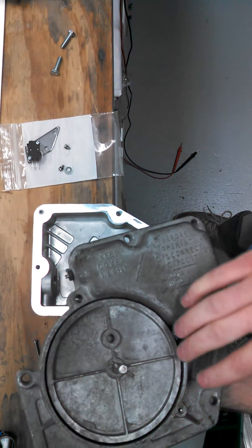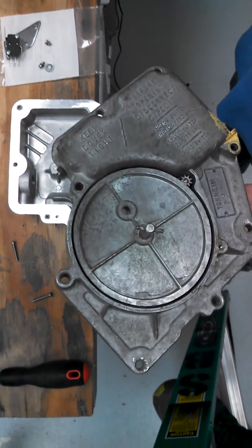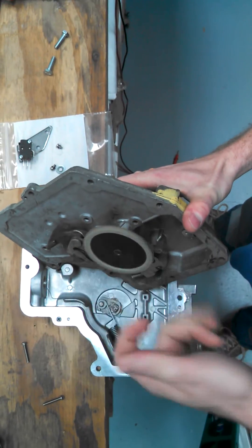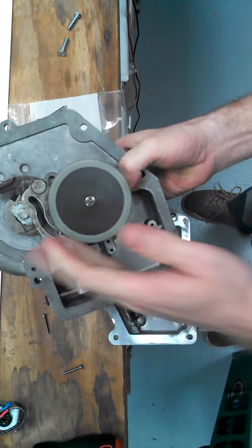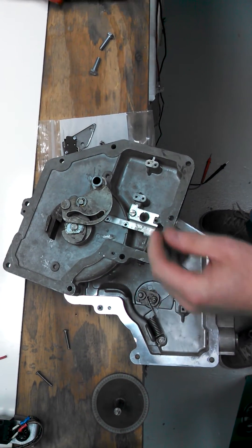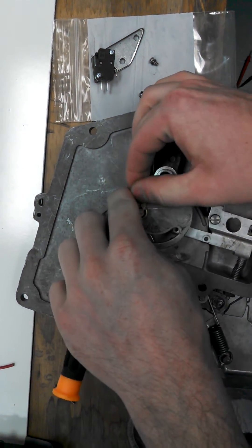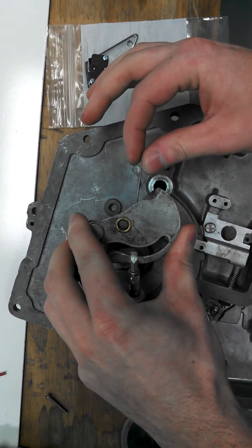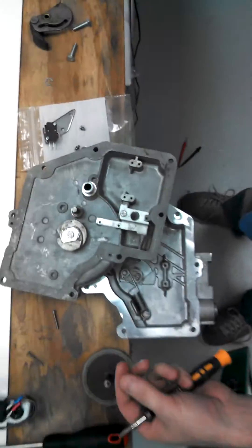After removing your screw, this plate comes off and you notice the little gear here. Using a small flat blade screwdriver and holding that in place, you begin to unscrew this shaft and take this gear out. Pull that out of the way. Then all we're going to do is remove this little clip and pull this cam — watching that you have a spring here, you don't want to get hit in the face. Remove that cam, and then it can either be discarded or used as a service replacement part in the field for another mechanical unit.